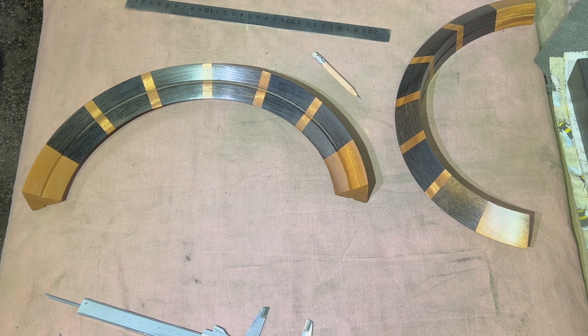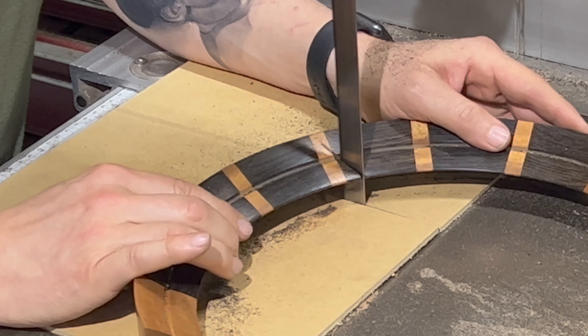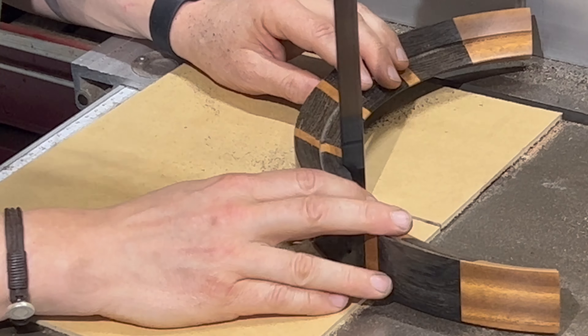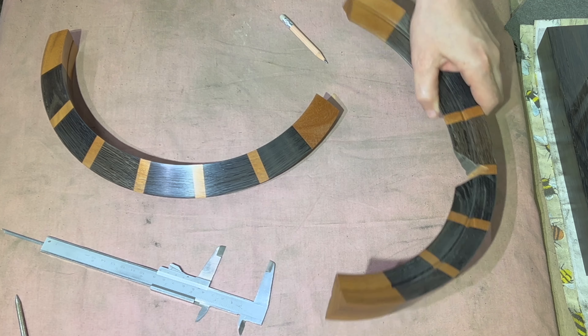Look, it's coming together — you can see that bit's for that bit, that bit's for that bit. I've sanded all these to 400 grit, sand-sealed them, waxed them, and put my stamp number on the back. Very happy. There are my polish rods — tap these rods in. The next important job is I want that surface there to meet this surface here, so I've got to cut a V in the dead middle of this. The V will be dead halfway so I need to come 28 millimeters. Just need the tiniest of marks and draw a little line. In all seriousness — fingers crossed.